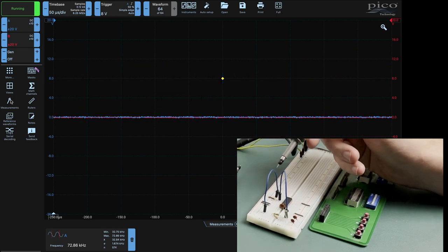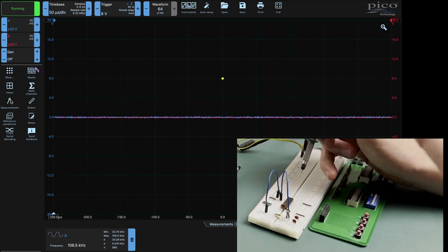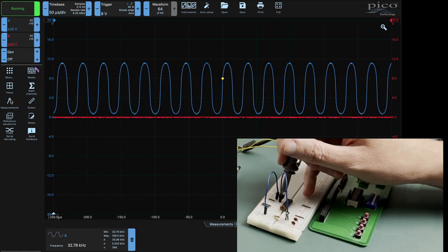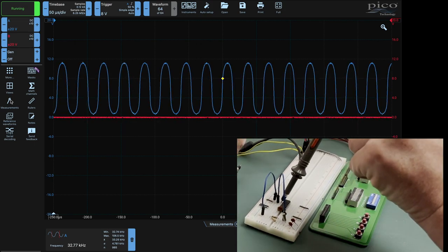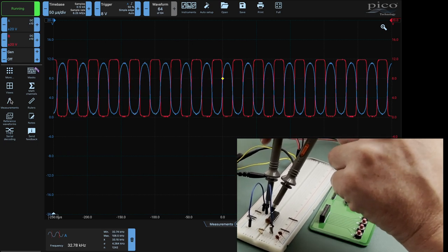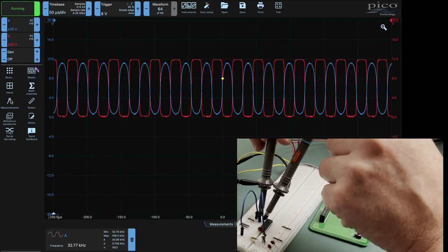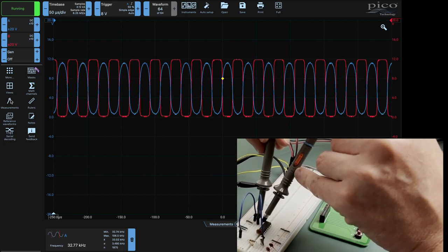So what's actually coming in off this wire here? Well, that should be coming off the crystal, and we'd expect to see the same frequency wave but this time a bit more curved. And there we go - that's exactly what we expected. Now if we probe both of these items, you can see it's actually the inverse, which is exactly what we expected because it's just after the inverter gate. You can see one is the wave coming off the oscillator, the other is the more square wave coming off the other side of that gate - exactly what we wanted.